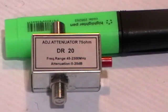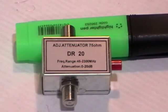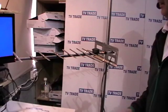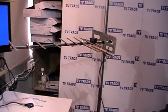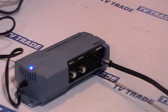So when would this occur? You can have a situation where you might be in a very poor reception area where, for instance, you're using a TV aerial like this, and you decide because the signal initially is too low, you're going to come along and put in a mast amplifier, a power unit, or possibly even just a distribution amplifier like this, which will give a certain dB boost to the signal.